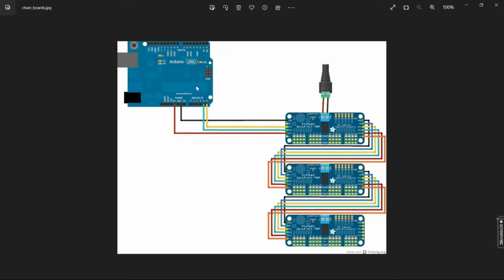We'll go into the connections a little bit different on ours because we're going to be using a Mega for the connections instead of a Uno, so the pins will be slightly different. But you've got your 5-volt and ground in and your data for the I2C connection there. The 5-volt in here drives the chip on the board itself. It does not drive the servos, and that's what this is for. This is your 5-volt power supply to drive the servos.